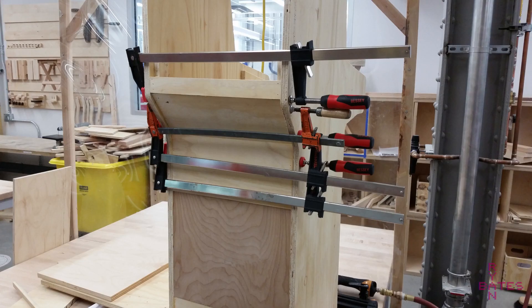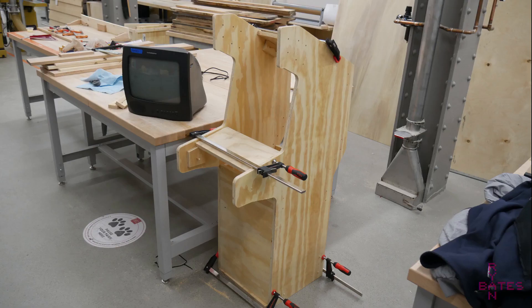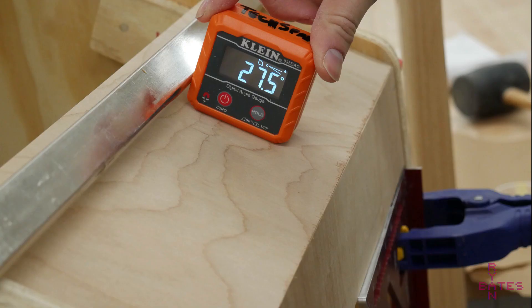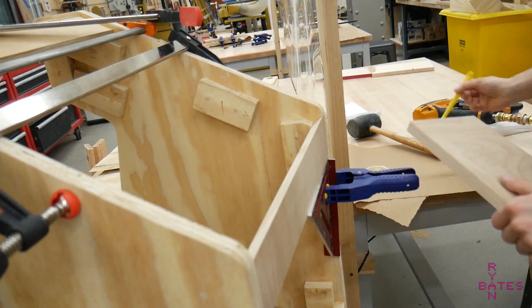The angles of the blocking in these corners involved a lot of guesswork, and it's a slow process to get panel lengths and angles correct. Building this in the dead of winter with about 20% humidity in the mid-Atlantic meant the plywood was drying out quickly and starting to warp, so clamps had to be on it at all times. A magnetic angle gauge helped match panel angles — you lay it on the surface, then put it on your table saw to match the angle you're trying to cut.